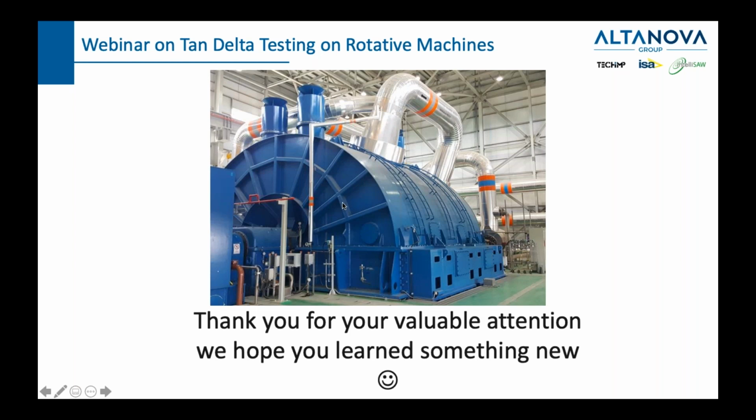There is an alternative solution that you also mentioned, Andrei, that is to perform the partial discharge measurement. And with that one, you can discover if there is a problem between one phase and the other phase. And this method you can apply even if you can't open the star point of the generator. Thank you, Mariela. Thanks for reminding me.